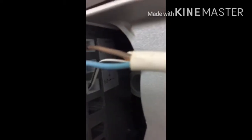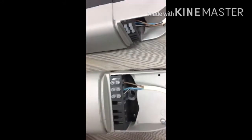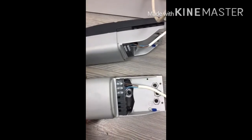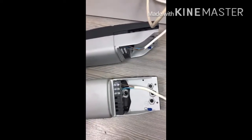On the motor side you can also see common, open, and close terminals, and motor two is the same. After programming, if you find the motor is working in reverse, you have to interchange the open and close cables.